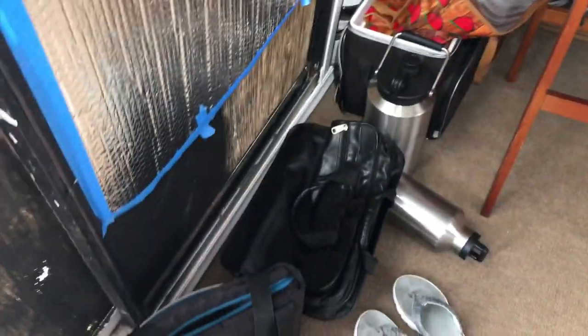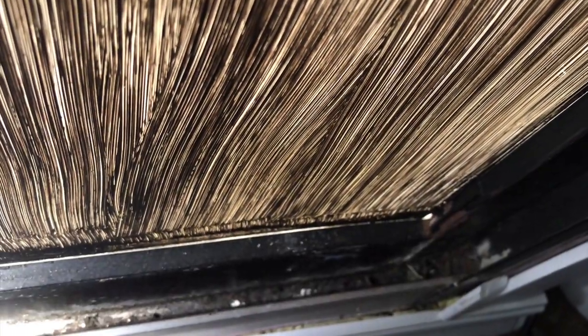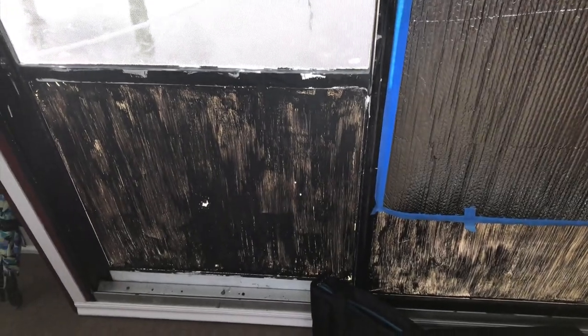I come onto the inside and I notice that this, get my light there for you, is damp on the inside. And what's this? This is right above that dang corner down in Trinity's room. So we're gonna, might even see if I can take this off. See how much work that takes. But definitely go ahead and clean this out, get it dried out, get all that sealed up on the outside, and then wait for another rain and see if that solves the problem, if we got some dripping down in there.